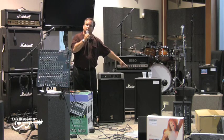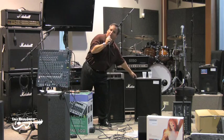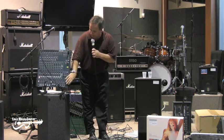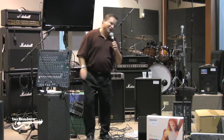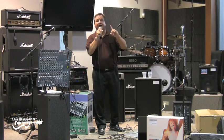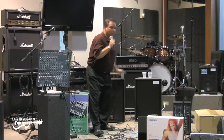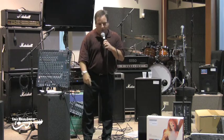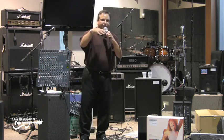So now it's just this speaker right here. This sound system is just this mixer, this amplifier, and this speaker. But this is loud enough, and my attenuator is not anywhere near full — I can get plenty more gain by just turning this up even louder. For a powered speaker, like the ones we're using here, this amplifier attenuator would be on the back of that speaker; we'd go over there and turn it down. Now listen closely — I'm not going to say anything. Turn off the microphone. You won't hear any hiss or hum at all. That's proof that we've set the sound system properly.